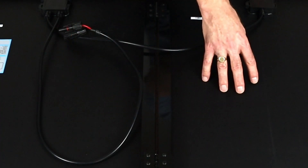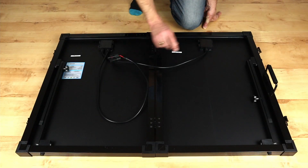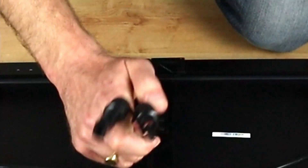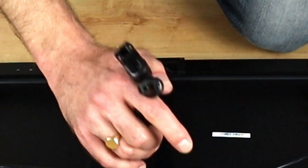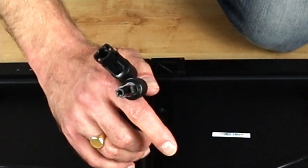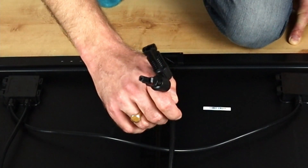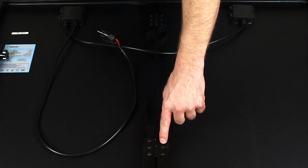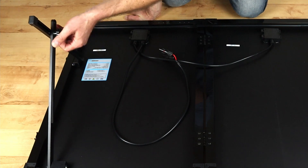These are actually two 50 watt panels connected together, connected up just like this. This cable goes into here and then that connection comes out to two MC4 adapters, meaning you can pretty much connect up to anything or even connect up to other panels in series or parallel that have these connectors. You can also connect this straight to any kind of solar generators or portable power stations, again if you've got the right cables. In the middle there are a couple of hinges, all riveted on, which is good so you haven't got any bolts that come loose.